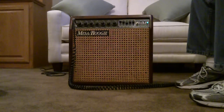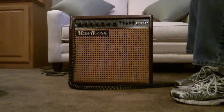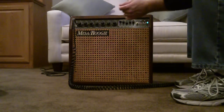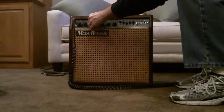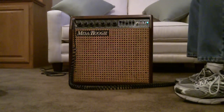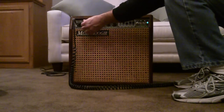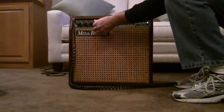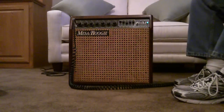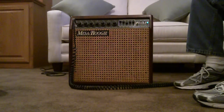The thing I want to point out is that the tone controls on the Mesa Boogie Mark III are totally, totally powerful. Right now the treble, bass, and middle are all on seven. If I turn them all the way down to zero — on a Fender Twin or something like that you'd still get kind of a flat sound, but on the Mesa Boogie Mark III you get nothing, absolutely nothing. So if you want zero bass, you've got zero bass, same for treble and middle. You'll probably find that you need to work for a couple of days with these controls to get everything set just exactly like you want, because they really are powerful. A small twist will make a large difference, so you've got a lot of flexibility on this amplifier.